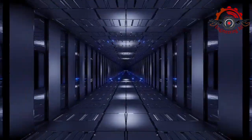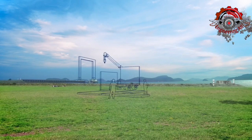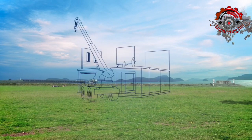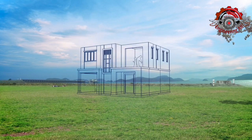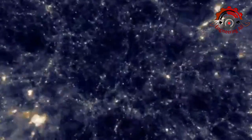Segment 9, doors and windows. Don't overlook the importance of sealing doors and windows. Properly insulate these areas using weather stripping, caulk, or expanding foam to eliminate drafts, and ensure a complete thermal envelope.